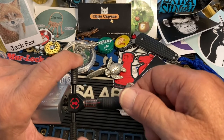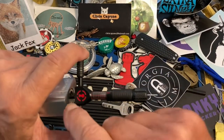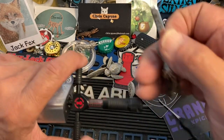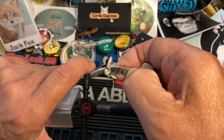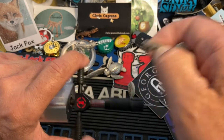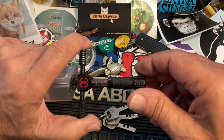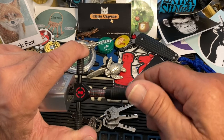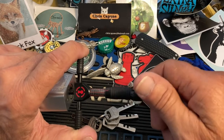You can still pick them without a standoff. I'm going to try this — I'm not real good at holding it because the little offsets give you a little more stability, but we'll try this one because it's simple. So we're going to read this key. The last cut is not a zero cut — that's the one we're tensioning off of. The second one is a zero cut, so the second disc our pick tip can reach is a zero. We're going to find that. See the play in there? That's what you want to see.